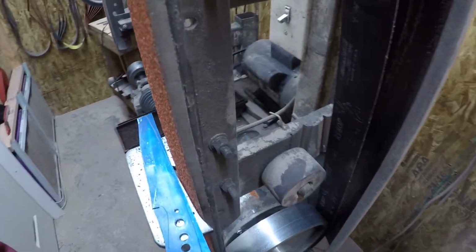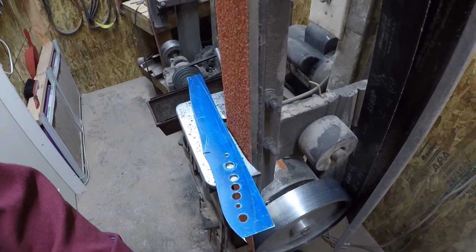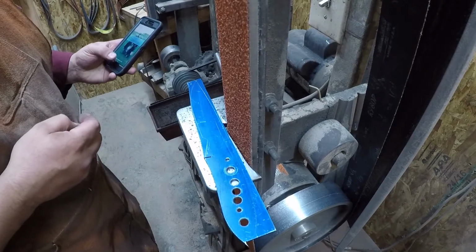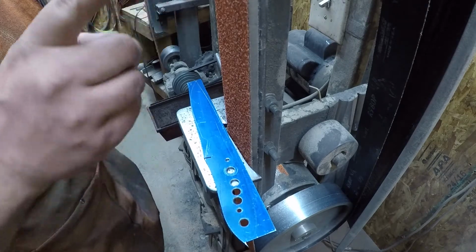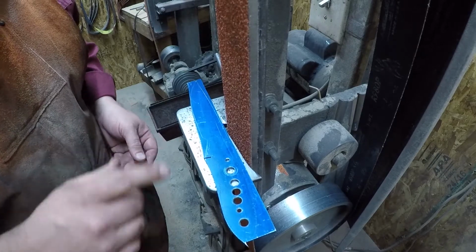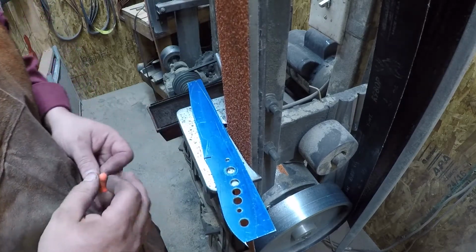They grind really good. Most of the stuff, and we'll get to this later, I grind after heat treat, and these work really good. They cut really well with very little pressure. They cut nice and cool. And once they're done grinding bevels, they get relegated to grinding profiles. This one is pretty worn still, there's hardly anything left of it. I probably ought to save the next one that I dull up grinding bevels for profiles, because this one's about done, but it'll still cut pretty dang good.